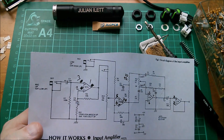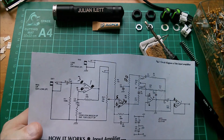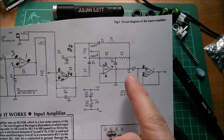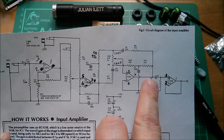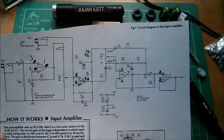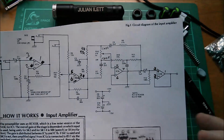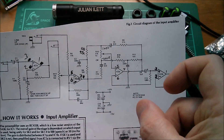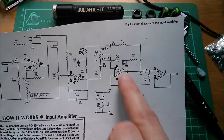I will put it plus to the mic socket. You can see that on the output side the 1 microfarad has actually been put the other way around, with positive pointing to the output, while this one is positive pointing to the input. I think designers just have their own ideas about this — again, it's in an AC circuit so it's probably going to be charged in both directions.